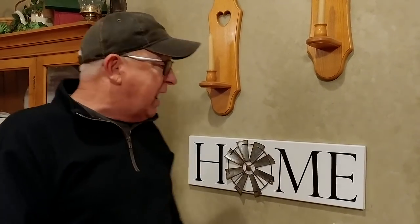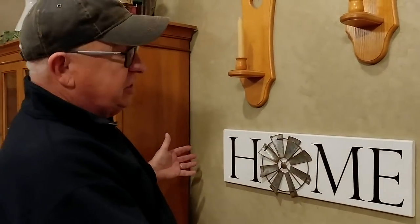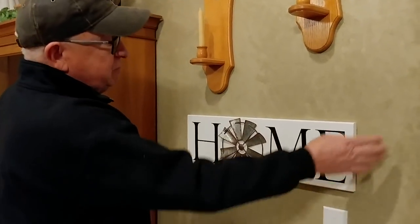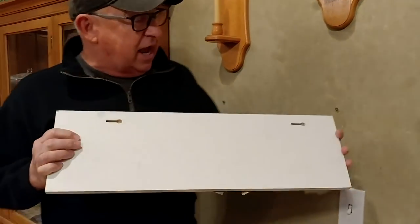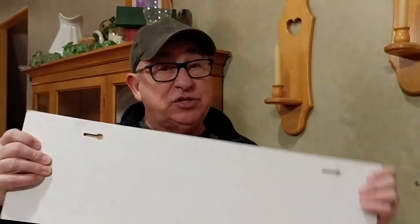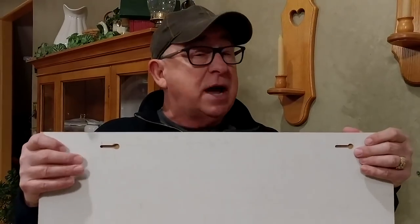Right now let's focus on how to properly mount a fixed point piece of artwork. We're going to use a piece of wall decor that Dirt Farmer Maggie made to show you how the process is done to get this artwork where you want it. You can see it's mounted equidistant from the piece of furniture to the door frame with a nice margin around it, mounted on a couple of screws using a keyhole slot method. You have to be pretty precise with this, and the method I'm going to show you is very precise.